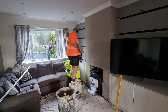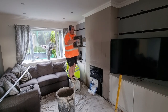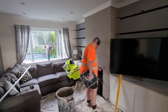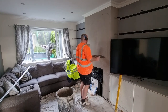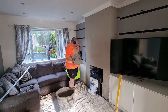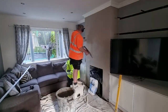So as you can see here, we're just finishing the last bits. I'm just going to throw a wee bit on around the side. I don't film this bit, but I fired what was left in the bucket, gave it a quick wash out and gave it a mix — another drop of stuff basically. Now the stuff's mixed. You see here, I'm just second coating. We're about to drop a fresh skim just in the second coat. It's always important to get it as flat as you can on the second coat. There was a bit of movement — you can see there around the stop beads around the gap for the fire, it actually did move a wee bit, and I had to spend an extra bit of time getting it right.